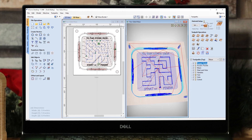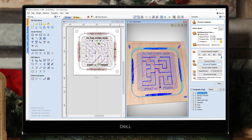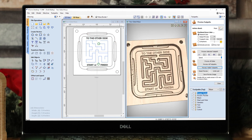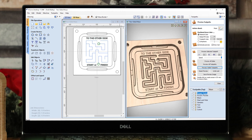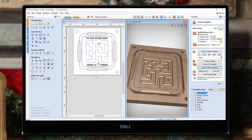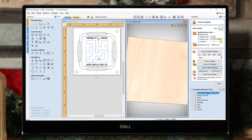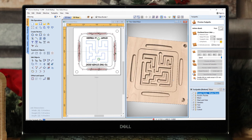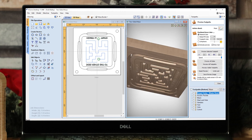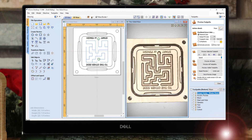Let's preview all of our visible toolpaths so we can see exactly how they're going to look in the material. There we have it — our channel, our start, our drop to the other side, handles on the side, a cutout pass all the way around the outside edge, and the pocket on top so we can drop in our acrylic to make sure the ball doesn't fall out when we flip it over. Let's flip to the other side and have a look at all the toolpaths there as well, which are pretty much the same. There's our interesting double-sided maze — let's put it on the machine, get it cut, and see how it works.